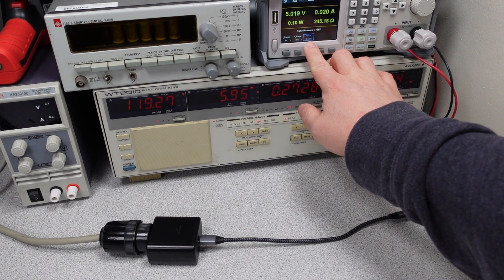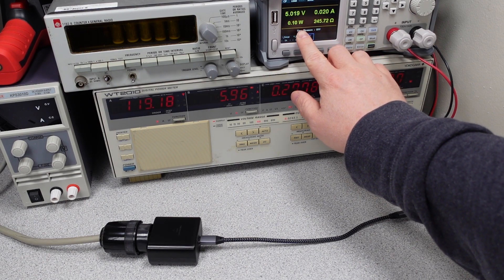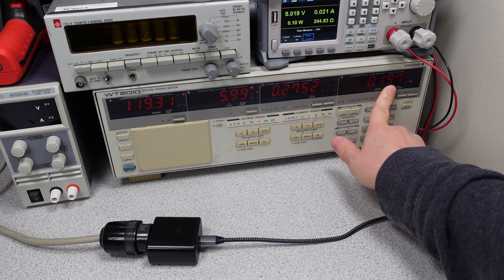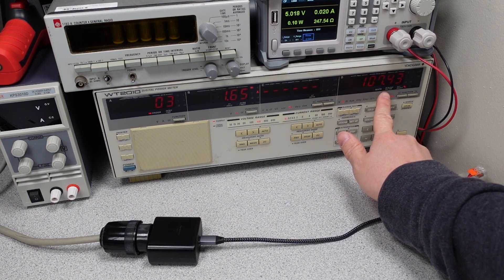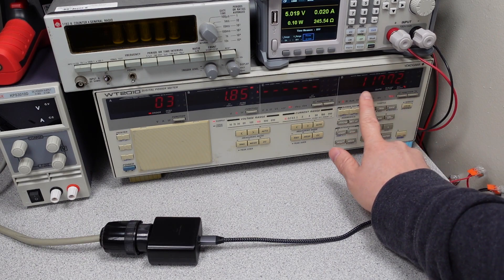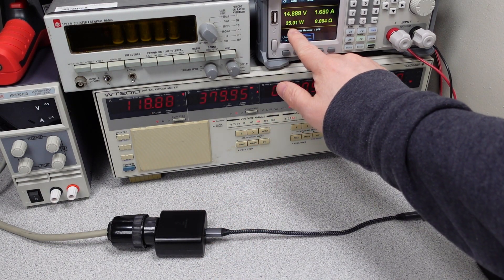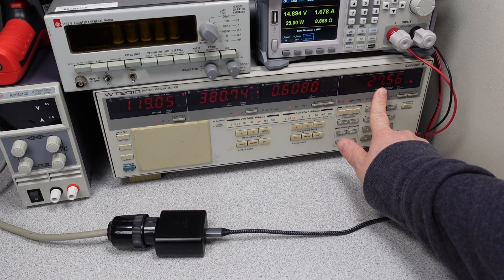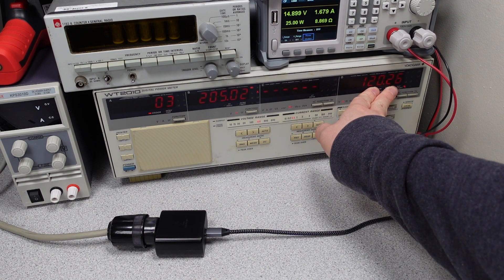Here we are running at a 0.1 watt condition — 0.1 watts of power being consumed, with about 0.2 watts of power in. That's actually very good efficiency for such a low power level. Our THD number has come up a lot, which is fairly common for smaller power adapters — essentially 115% of the signal is noise at this level. Now I've brought it up to about a 25 watt load using the 15 volt mode, and power consumption is still pretty low, keeping that efficiency nice and high.